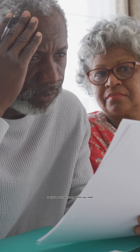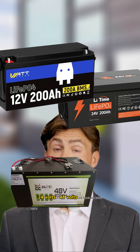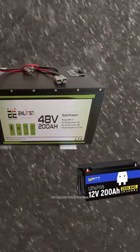To figure out how many panels you need, we have to answer four critical questions first. The first question is: what's your battery voltage? A 200 amp hour battery could be 12 volts, 24 volts, or 48 volts. And here's the kicker — that makes a massive difference. A 48 volt 200 amp hour battery stores four times more energy than a 12 volt 200 amp hour battery. Four times. So right off the bat, we need to know which one we're talking about.